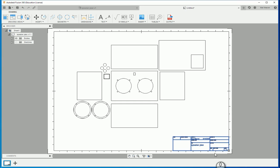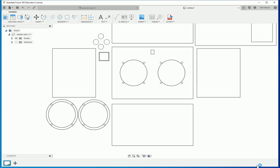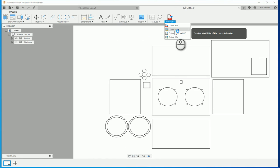You only need this — this is what the laser cutter will see. It will see these holes, these lines, and it will cut them. To do that, you're going to output as a DXF, output as a DWG, and output as a PDF. So there's three different outputs, because if one doesn't work, the other two will. So you simply do that — save that file. That file we can then push directly on the laser cutter and it will cut. And that's that.